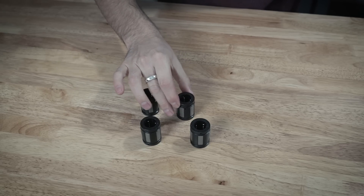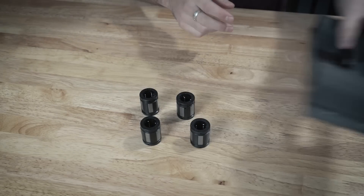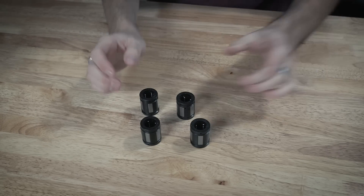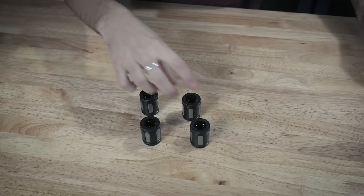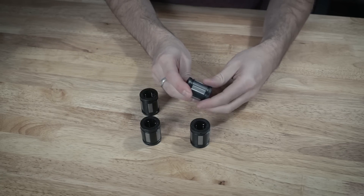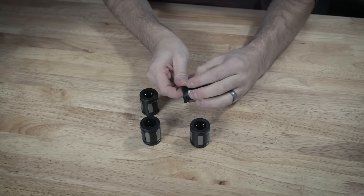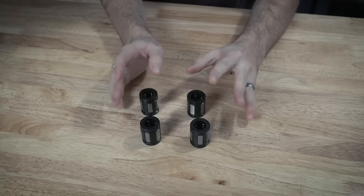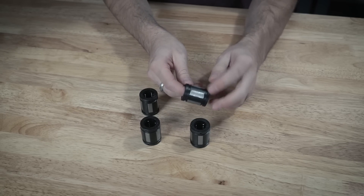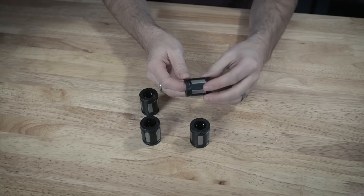What's happening is the bore on the bearing block is ever so slightly too large, just by a tiny bit. So I'm using this aluminum tape and I've cut off just a couple of pieces and stuck them to a couple of these little metal pieces so that they can't expand as much as they should. I played around with this a little bit — I did four on one of these and it kind of bound up.